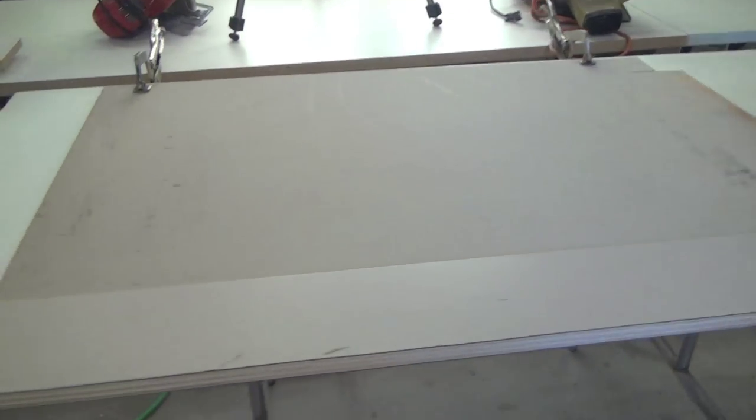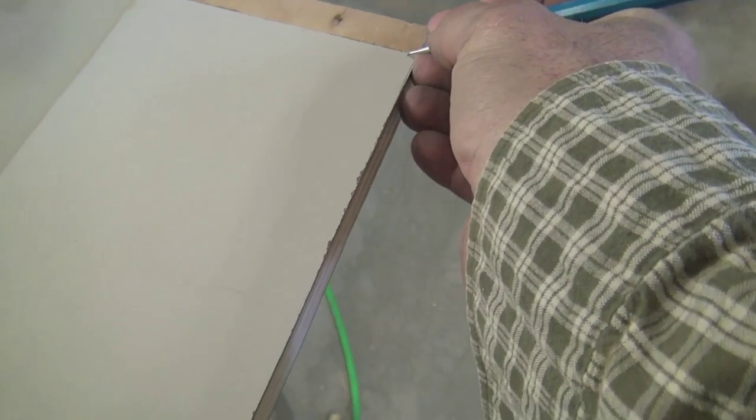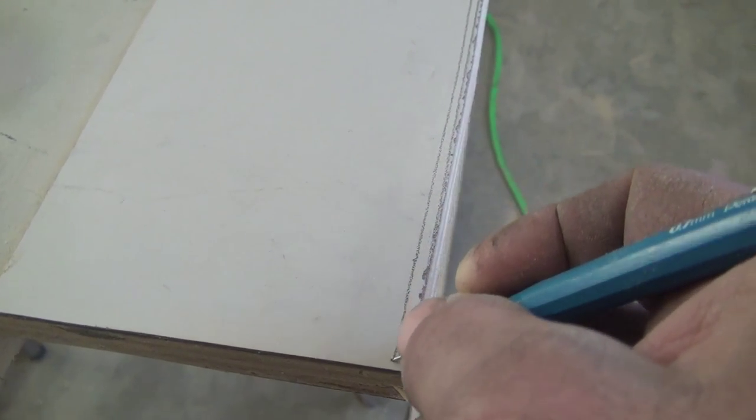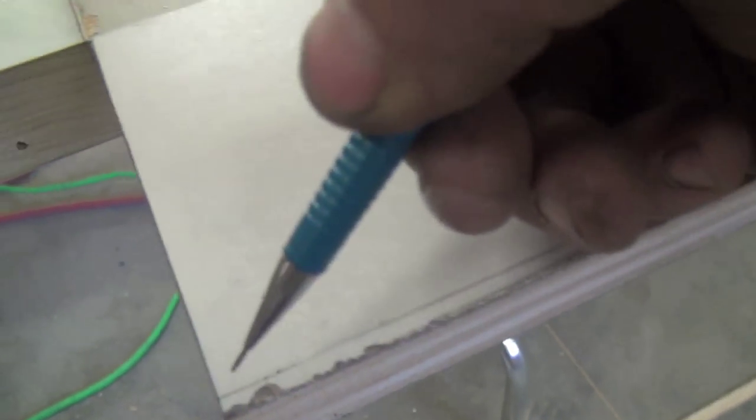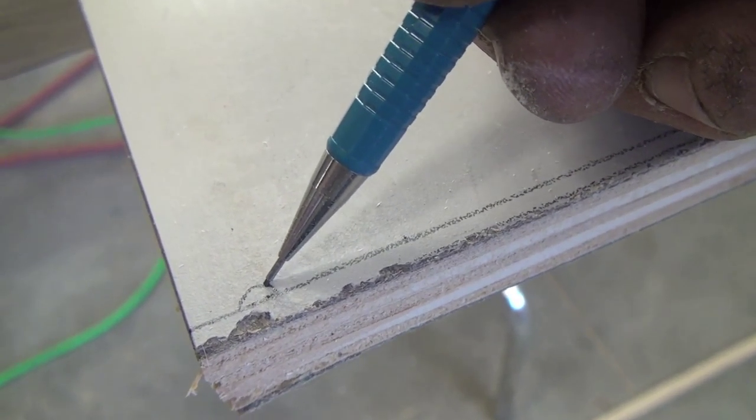Normally you would leave an eighth of an inch and then come back and sand. If you were doing this professionally, that chip out would be a big no-no. Let's take the dust broom and clean this off now. I'm going to do the same cut, this time going backwards. I'm just going to take the line — go right up to this line, about a quarter of an inch. You'll see that when I cut this line, I can cut it exactly on the mark, without any chip outs. It's going to be a nice clean cut.